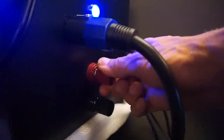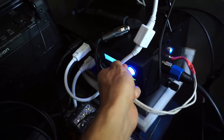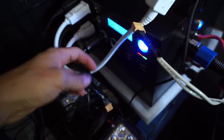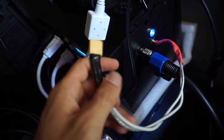Be aware that the battery expansion terminals are always live. If exposed and they touch something metal you could have a huge short circuit and damage the Kodiak. Always put the terminal covers on, and if you connect external batteries you should add a fuse since these are live all the time. I also made a multi-use cigarette lighter adapter with an XT60 connector so I can plug it into anything XT60 compatible — these little lights, for example — and also use it to charge the Kodiak.